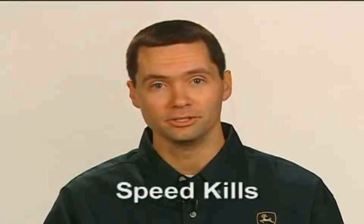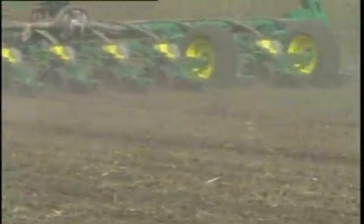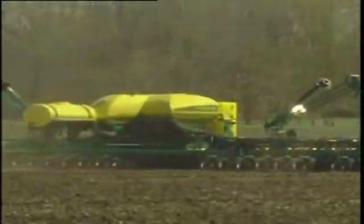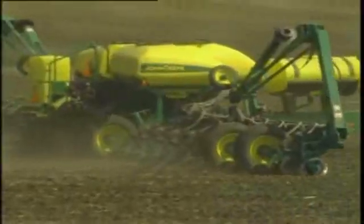My second bit of advice is simply: slow down. When you're faced with cold, rainy weather and you're looking to bump up your speed to get over more acres faster, don't. Operating speed has a bigger impact on spacing than you might realize. Speed kills planting accuracy — both in spacing and depth — and it limits yield potential. I've found a lot of guys get optimum seed placement when they make sure their planter gets inspected, every row unit is tuned up, and they use the correct operating speed when they plant.